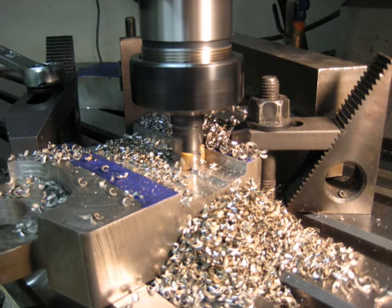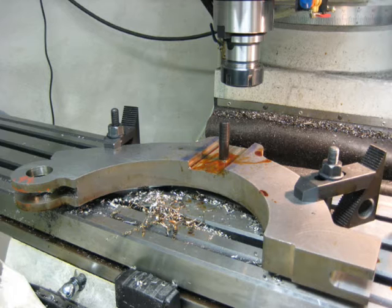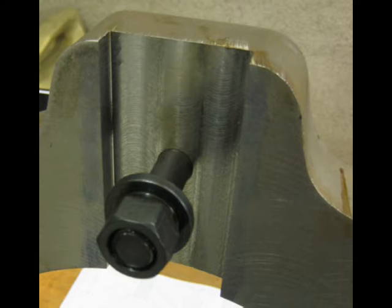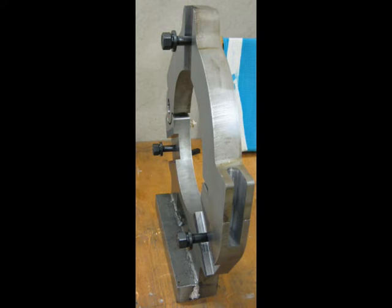Here I am cutting the slots for the fingers. This went pretty nicely. I am using a Sandvik R390, 20mm diameter. I don't have any video of the drilling and tapping for the hold-on studs — it's too bad really, because the power-tapped M16 went really smoothly. This is how the steadrest has looked after drilling and tapping for the three studs.